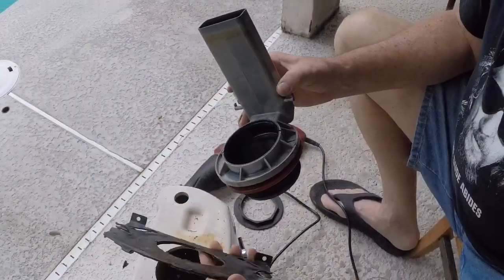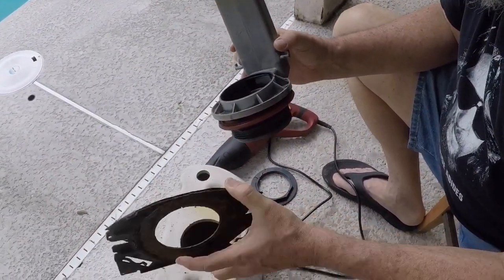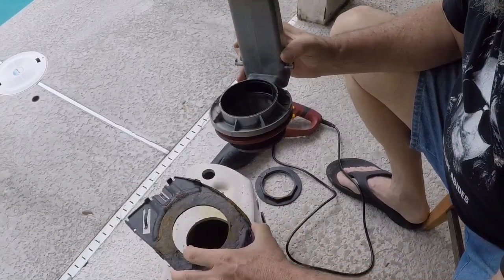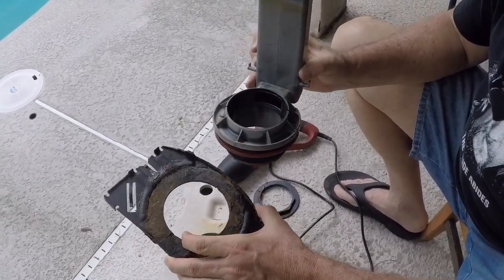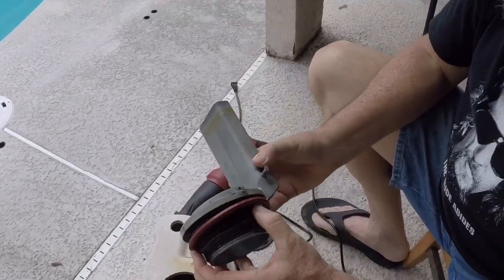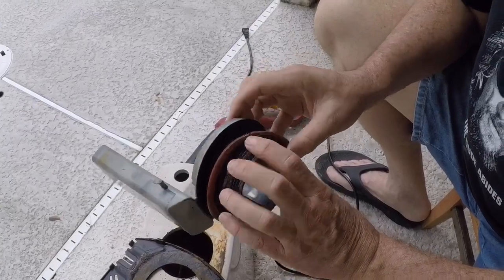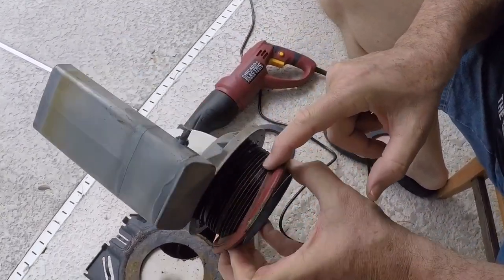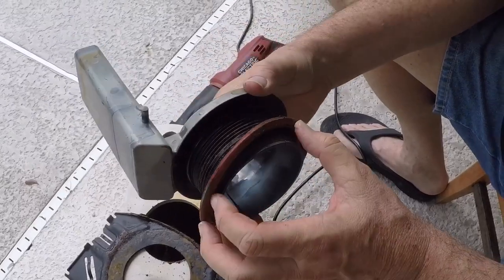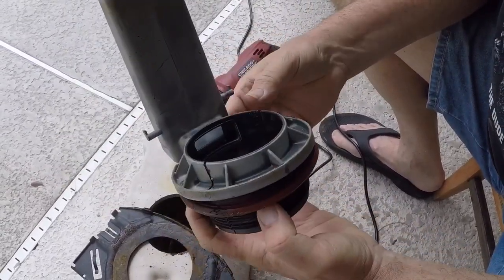Examining this plate here — it's corroded, very laminated. I think what happened over time is that when it became corroded it swelled up and it loaded that nut on the flush valve so you couldn't get it loose. Also, looking at the threads here, they're packed with rust, and I think that's part of the reason I couldn't get this thing loose.